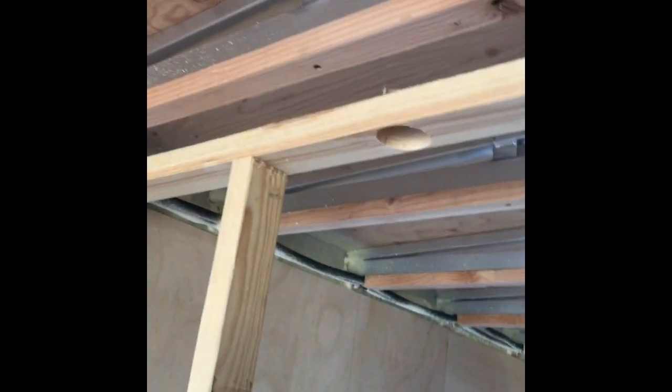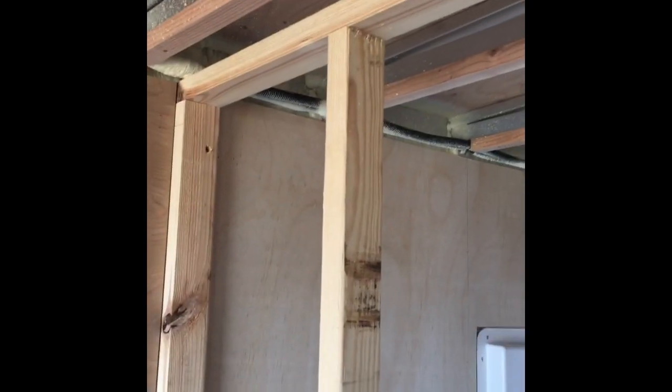I'm gonna leave this side of the wall open because a lot of electrical wires are gonna be run through this wall coming down to my refrigerator and furnace and tankless hot water heater and the stove and everything. I'm gonna go ahead and install my vent pipe through the roof. But I'm gonna plywood the inside of the bathroom wall and finish around the top, on both sides.